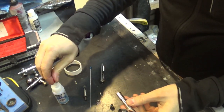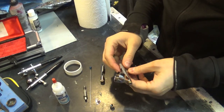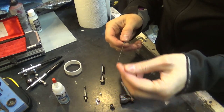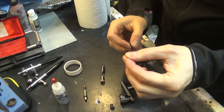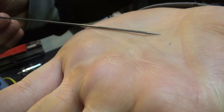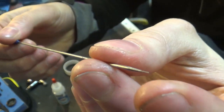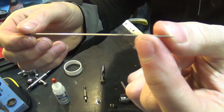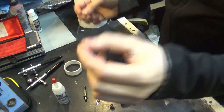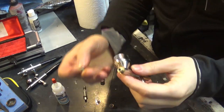You can also use lubricant on top of the PTFE tape once it's wrapped around the thread — that helps prevent leaks and makes reassembly easier. This is also a great exercise because you'll need to clean your airbrush quite often. In-depth cleaning like this is sometimes necessary — not after every use, but I clean mine often, and before every major job I always take it apart, lubricate all the parts, and make sure everything is clean. Make sure the needle is straight — don't drop it or bend it. If the tip is bent, you'll most likely need to replace it.